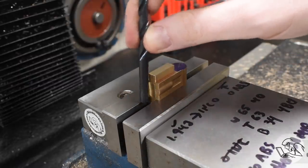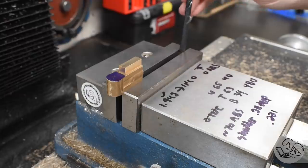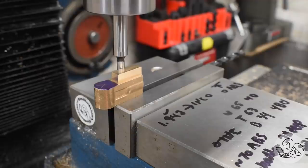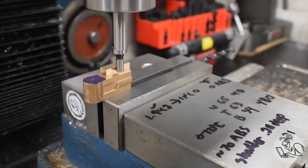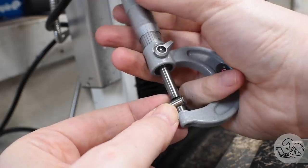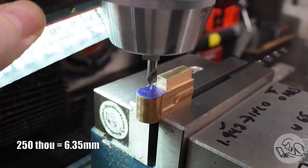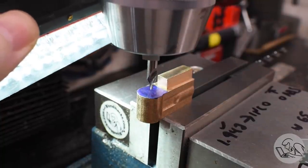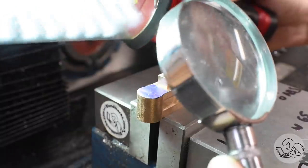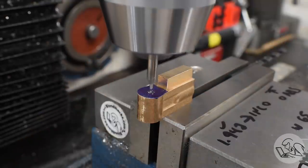I was hoping to clamp it for drilling but the drill isn't going to clear the vise jaws, so I'm setting it up on the edge of the vise. To ensure good grip I'm putting a drill a couple thou smaller than the part on the other side of the vise jaw to keep things square, then edge-finding on the Y-axis to center it up so my bore is centered on the leg. I'm also double-checking the factory-supplied pin - the one that came with the clevis was a bit undersized but this one is dead nuts on 250. I'm eyeballing the center of that little triangle and making a little mark, double-checking with calipers.